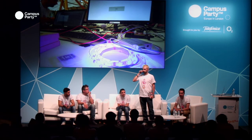Then we wanted to show some Android power in these demos. Of course, there is an ADK connection implemented. That means the two processors can communicate through the ADK protocol. It also means that UDOO is an Android device and also an Arduino accessory embedded in itself. We think this is very useful because a lot of people can program in Java, so they can make their own Android application and then communicate with the Arduino through the ADK protocol. And we have a little demo at our desk,